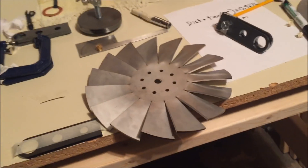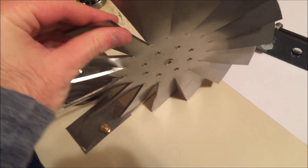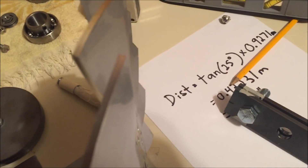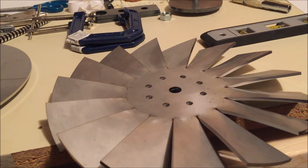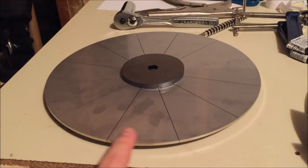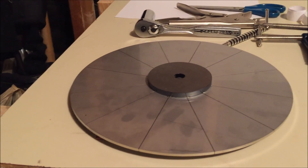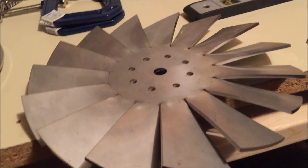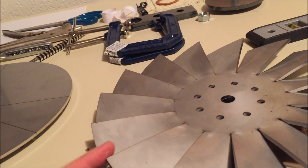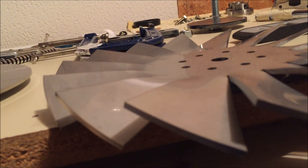Stage two is done in terms of blade bending — turned out pretty good. The center stayed perfectly flat and the initial profiles look pretty good. The next video should be up in a couple weeks. Stage one blades will be bent by then, and stage two blades should be completely done in terms of their airfoil shape — specifically the leading and trailing edge shapes. These actually need to go through another bending process, which I haven't figured out yet.